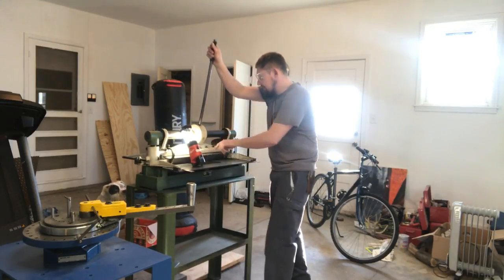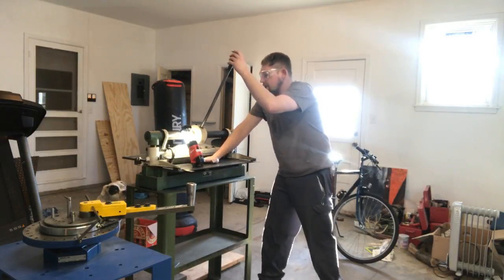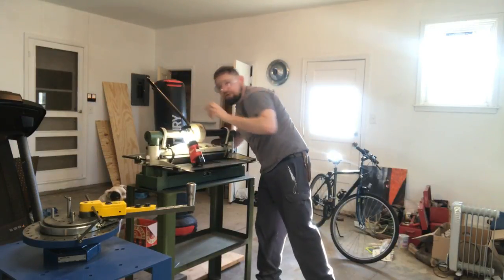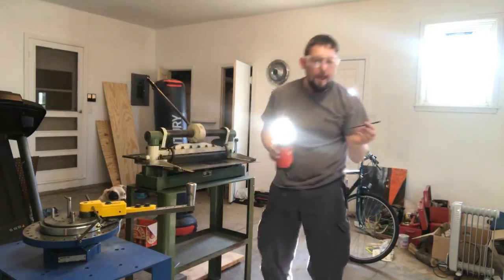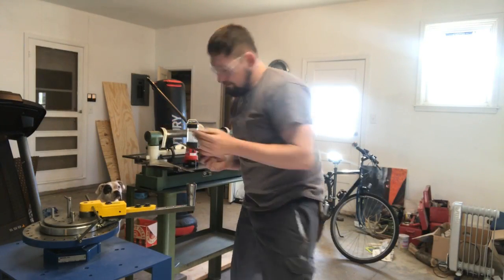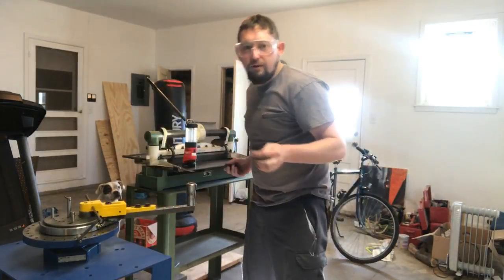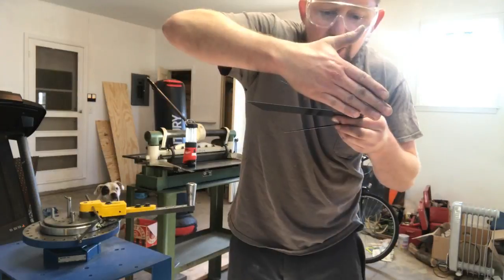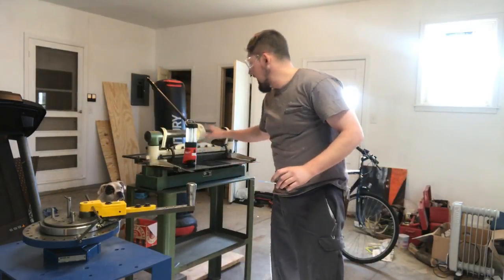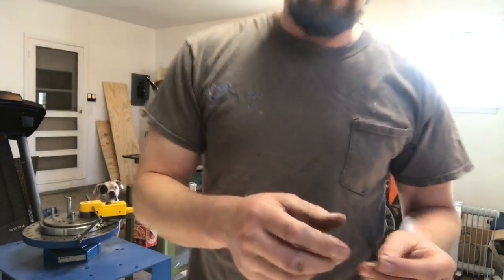And it has a good clamping edge too. I found it may move a little bit, so I put my hand down on it and do a quick shear. If you shear too slowly, I've noticed, the tendency is the shear will move it more than if you do a fast shear. I almost perfectly matched the line I drew there. So just get it adjusted, get it held good, make sure your hold down is adjusted well. One good shear, bam, done.